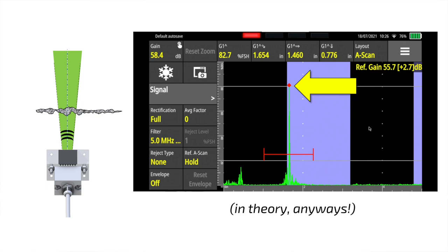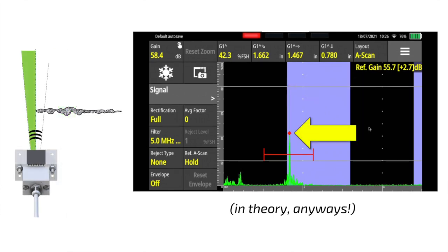If you're not familiar, this is where you take the probe, find the flaw, move it back and forth, find the peak, mark that position, and then take your probe and move it either side until the signal drops halfway on your screen — which is a drop of six decibels. You put two little white lines, draw a line in between, and go 'yay, I found the flaw length' — but you probably didn't.